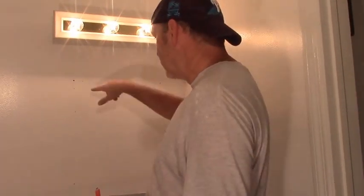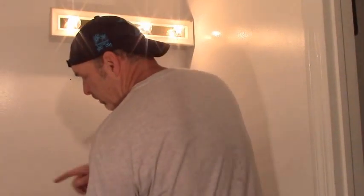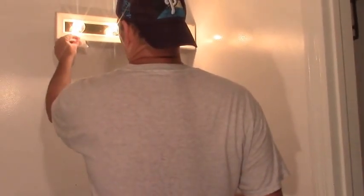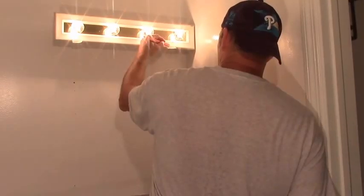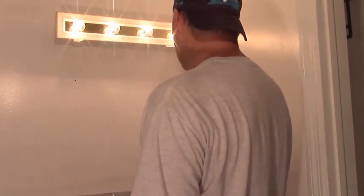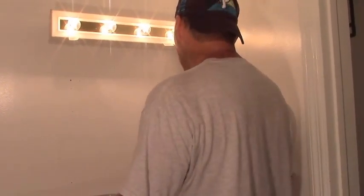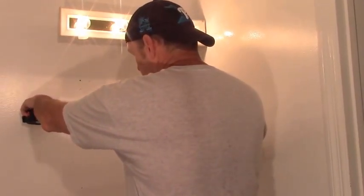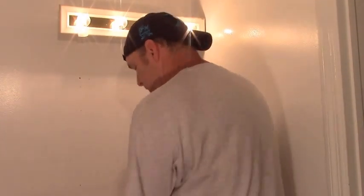How do I translate those marks to where I want to hang the cabinet? There are two ways you can do it. What I'm going to do is eyeball up onto this light and just put a piece of tape there. I put marks up on the light. Secondly, I'm going to measure over from this corner wall to my two marks — I have five and a quarter and 21 and a quarter. So when I hang the cabinet up, I'm just going to move over that far.